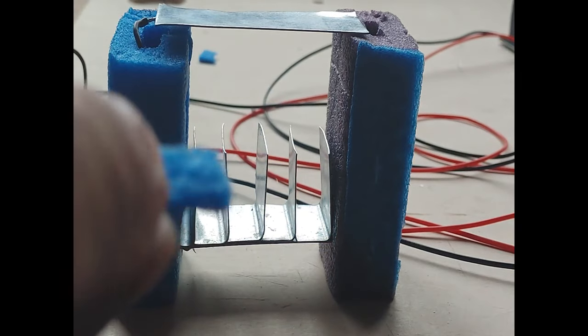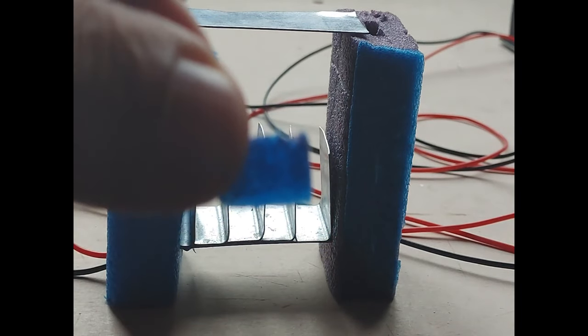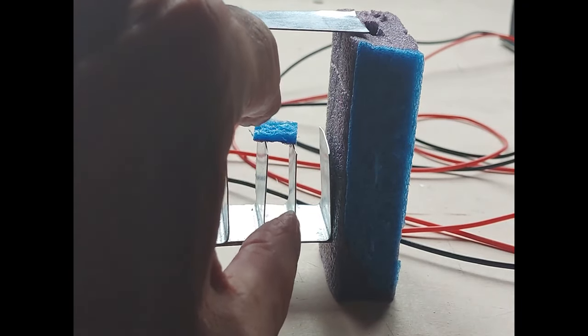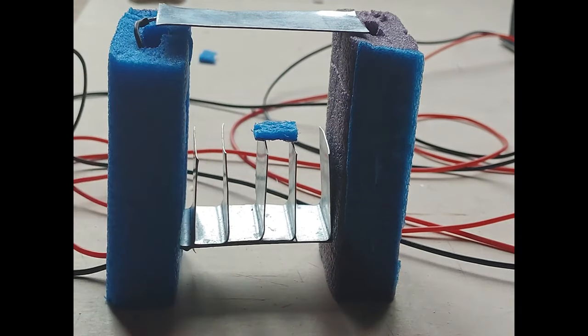We're going to take a high voltage field, positive on the top, negative on the bottom, and we're going to take this piece of packing foam and we're going to get it to lift up. But it won't do it right away. It's going to stay at the bottom and build a charge. It's building the charge in it to be negative. Then, when it's completely full of negative charge, it'll then lift towards the top.